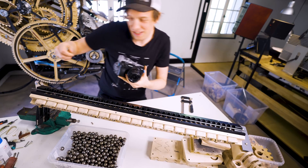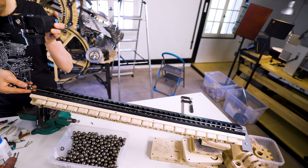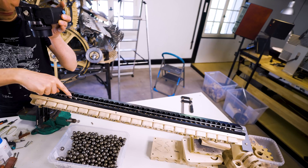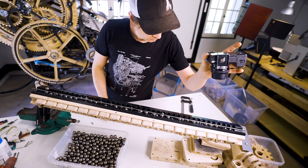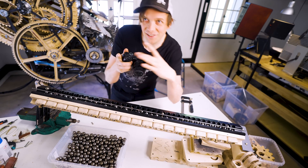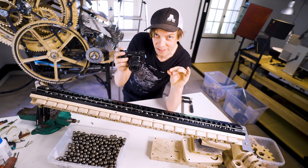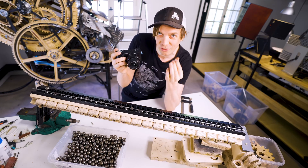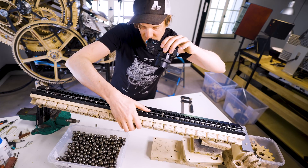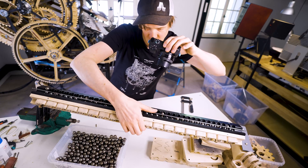Test three, 20 degrees — the marbles will roll easier. So far the marbles are still hitting each hole, that's good. Already 20 degrees performed better than 25 — nothing got stuck. It just works, even in big groups. So I'm going to again change heights for 20 degrees, changing the marble height on each channel.